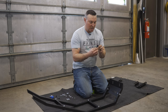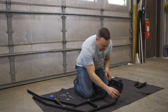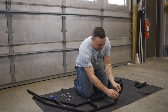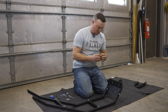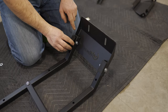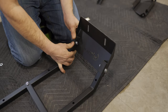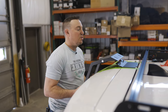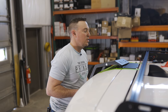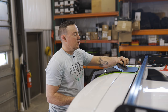One last thing — we're going to slap on these rubber pieces. Just peel the backing and they're going to go on the inside of the ladder rails on both sides. So we got our rubber pieces installed on the inside of these rails. Let's go ahead and slide these over our carriage bolts and get our nuts started. We're not going to tighten it down just yet — just start them.